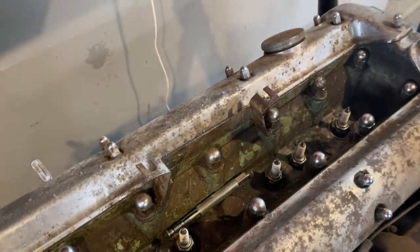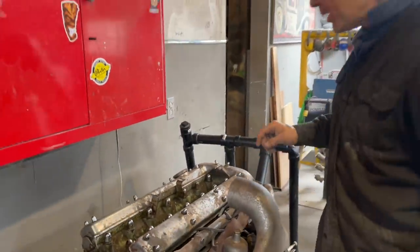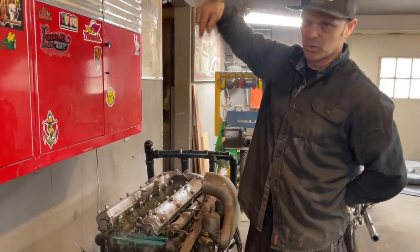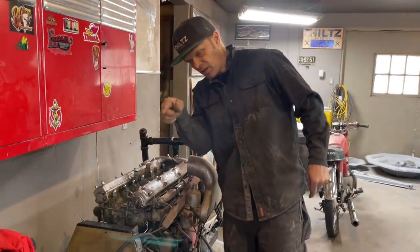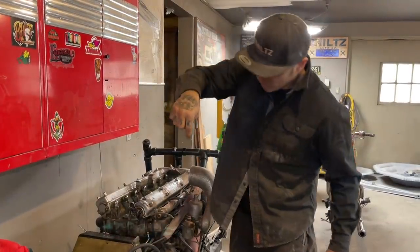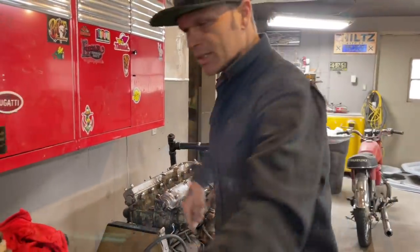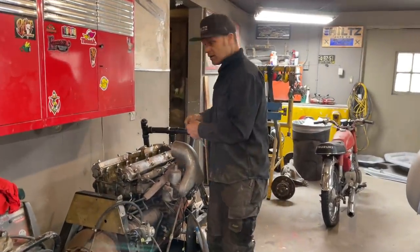This is what I found out — when I welded inside the spark plug, welding down the inside the center of it, that didn't work because it pulled right out. The first time I had welded onto the side of the spark plug and started welding that way, then turned my weld to try to get some weld to the inside of the spark plug. I filled it up really, really hot and made a little puddle out of it, but it wasn't going anywhere.